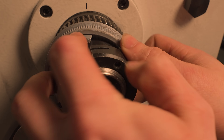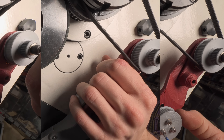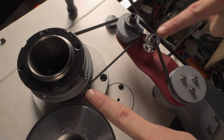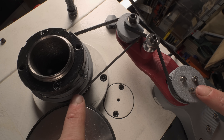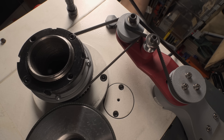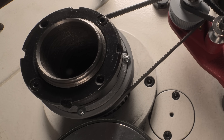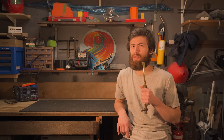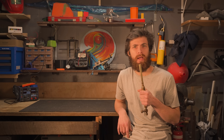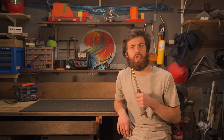The first point of order was to fit the large split pulley to the back of the spindle, and then I could mount the encoder and its tensioner arm. From the spindle to the idler pulley is a 1 to 2 ratio, and from the idler to the encoder it's a 2 to 1 reduction, meaning the spindle and encoder should be rotating 1 to 1. This reduction situation might look a little redundant, but it's really the only option when you couldn't be bothered to wait for a belt large enough to wrap around two 120 tooth pulleys to arrive in the mail. And hopefully at high speeds, these smaller pulleys will be less likely to explode. Using a 6mm unbranded GT2 belt in this application is asking for trouble, but it's the only option when you couldn't be bothered to wait, so it'll just have to do for now.